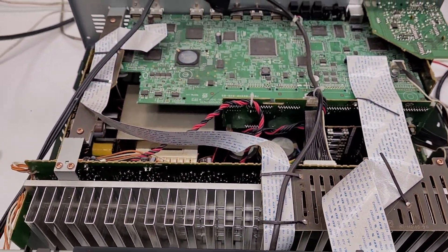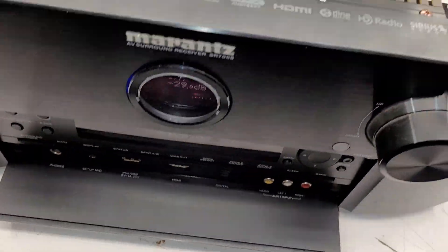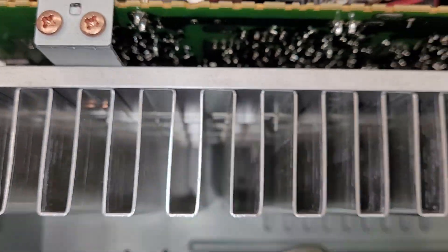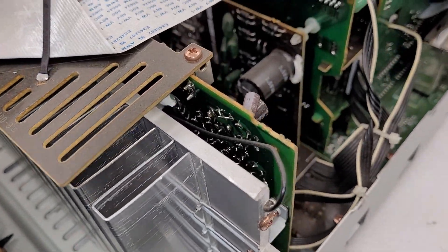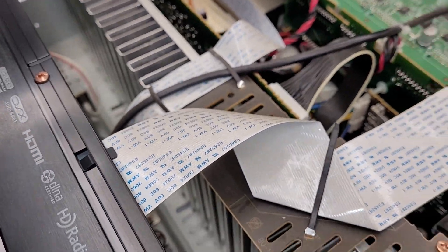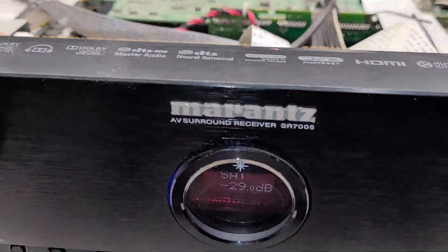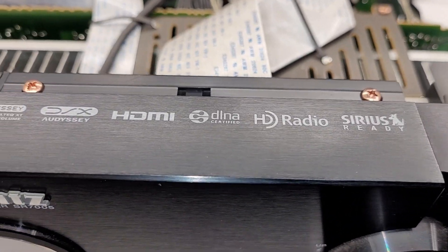I just don't know what to do with this thing. Got a movie playing and it's working absolutely perfectly. I've tested the tuner, various inputs, MP3 inputs — it's working absolutely perfect. So I think I'm just going to go ahead and give this back to the customer with a half-hour diagnostic charge. Unless he can provide a specific symptom for what this thing is doing, I think this is going to be the end. Once again, Denon-Marantz — not too terribly happy with the size of the small heat sink with no fans for such a large unit. That is the Marantz SR7005 receiver — nice looking receiver, definitely got a lot of functions.